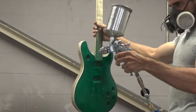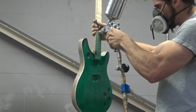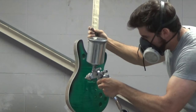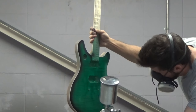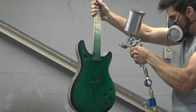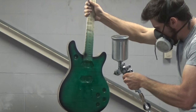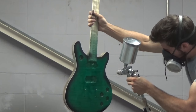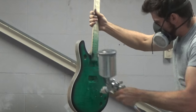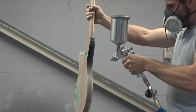I'm using a 1.5mm nozzle on a fairly large gun with the fan pattern turned all the way down. This part of the video is sped up to 200%, so it's going twice as fast as I actually did it — if you can't do it this quickly, that's not an issue. This probably would have been easier with a touch-up gun with something like a 1mm nozzle, which is better suited for smaller detail work, but if you're careful this should work just fine.